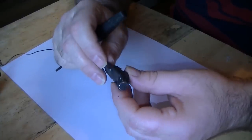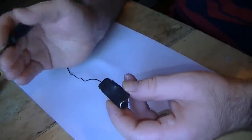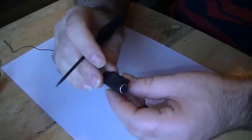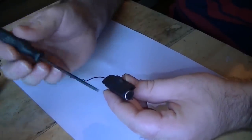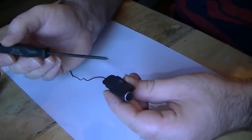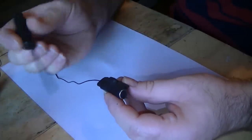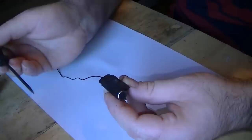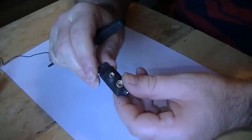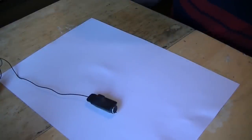Well, first thing we need to do is make the circuit board. Now I could use DipTrace, it's what I normally make my professional boards with to get them manufactured in China. But with this circuit, I'll just use, I think it's Paint Shop Pro, or somewhere similar, to just create a circuit with a paint program. So anyone can do it. What we'll do first of all is design the circuit, print it, and we'll use the toner transfer method to create the board. All right, let's get on with it.